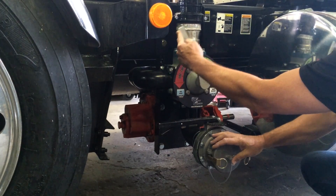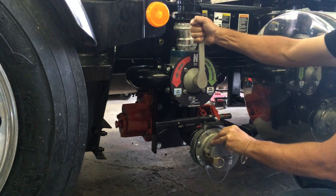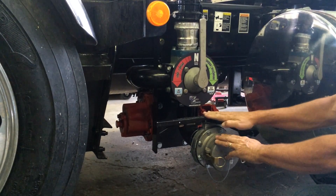You can always move it when it's pumping — even out of the window — with one finger. If it requires a full hand to push it, it's resistant and there's a closed valve in the system.